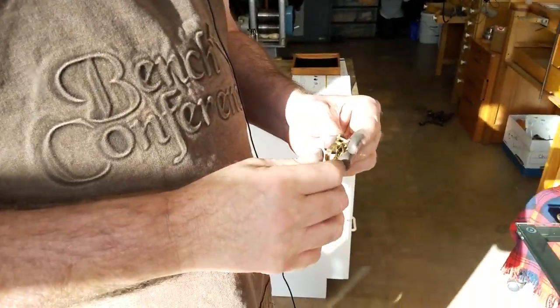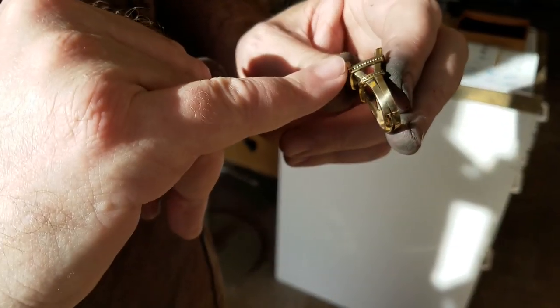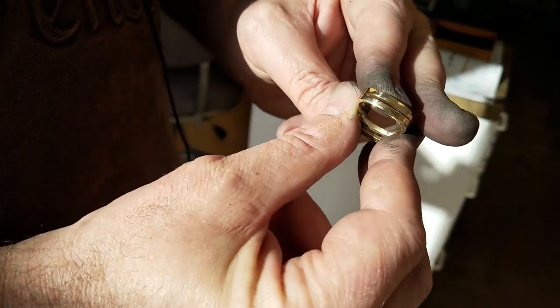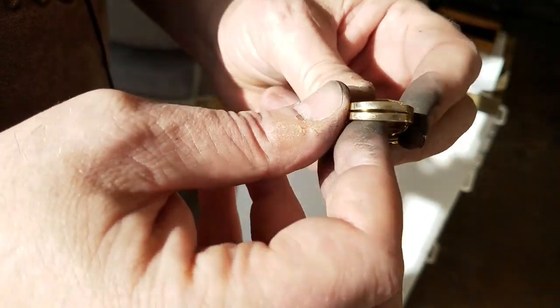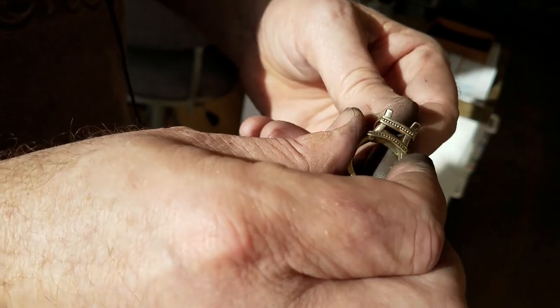I just finished going over everything with the Graystar. What you want to look for — I haven't cleaned it yet — is that everything is blended. One of the great ways to do this is to look in the light and see how the light is reflecting off the piece. A lot of people put too much compound and end up with a ring completely covered in black. You really just want to see the metal — looking at it in the light is a great way to see if your surfaces are nice and shiny and straight. Once you've gotten through the Graystar, that's the shape it's going to be. The next step with the blue or whatever finishing compound you use is just going to make it shine and bright — it's not going to change the shape at all.